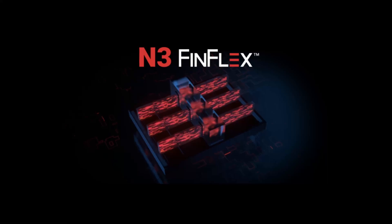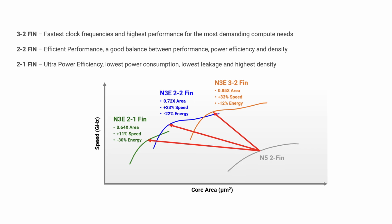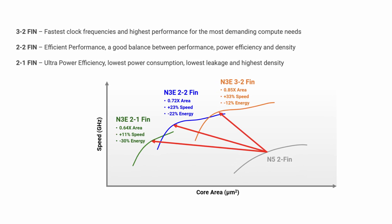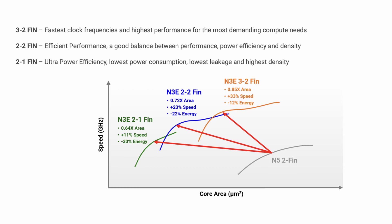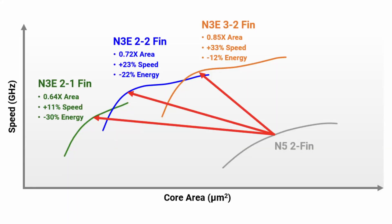I'm not so convinced that's going to be the case with M3, and that's because Apple is now using TSMC's N3 process, which incorporates something that TSMC call FinFlex. What FinFlex does is it basically gives the chip designer three choices: they can lean more towards efficiency or they can lean more towards performance, and we'll put those three grades up on the screen. If you want more performance you increase voltage and die size, and if you want more efficiency you go in the opposite direction. What's great is that every single one of these three choices is both more efficient and more performant than the previous N5 process.